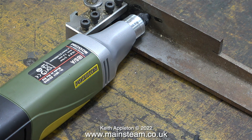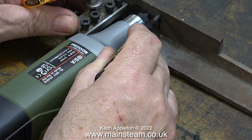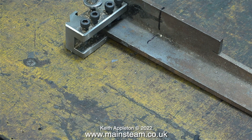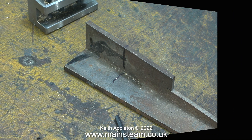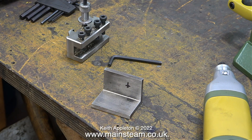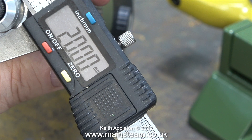This is very approximate but my eye tells me it's in the right place — at least it's in the middle of the piece of bar. In this clip I'm marking the cutoff point but in reality I marked it in the wrong place. It's unimportant because this is only a mock-up. I cut it to the right length — or in this case the wrong length. To be perfectly honest, to make a proper tool post grinder I would not do it this way, but this will be fine for a quick mock-up proof of concept. I cleaned it up slightly, marked the position to drill the hole, and with the help of my digital caliper found out the size of hole I needed — 20 millimeters.